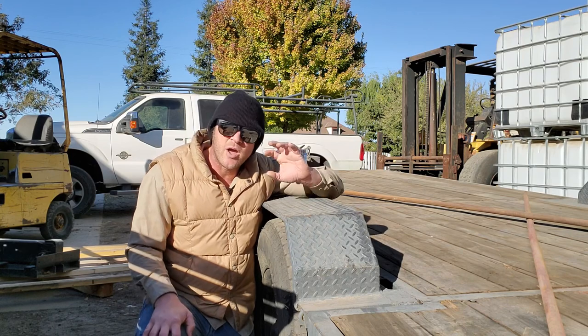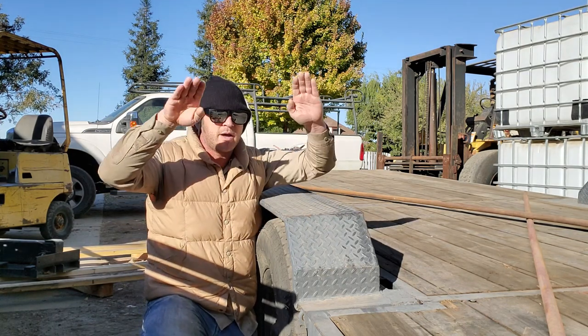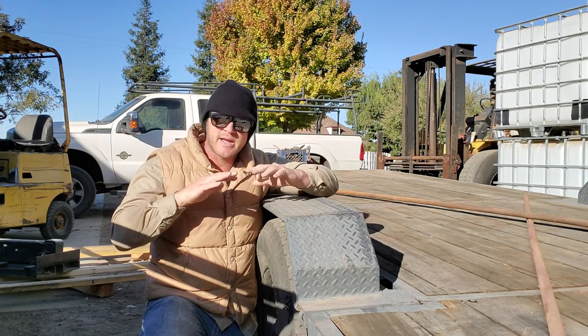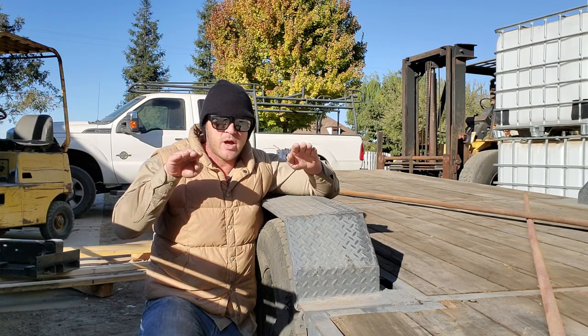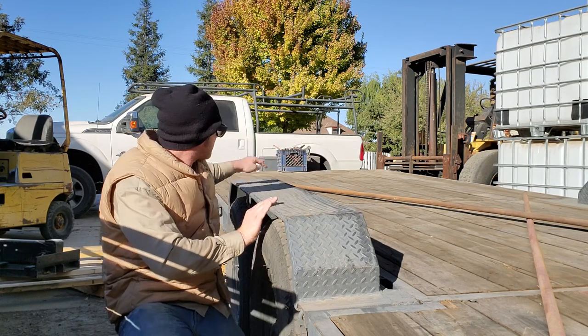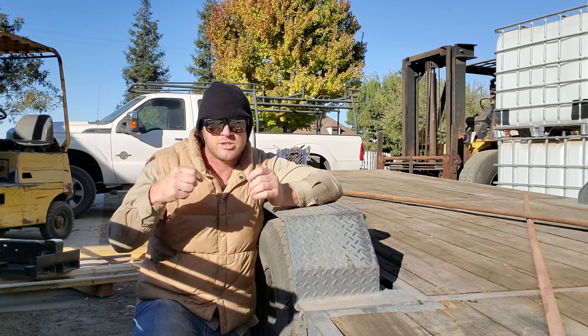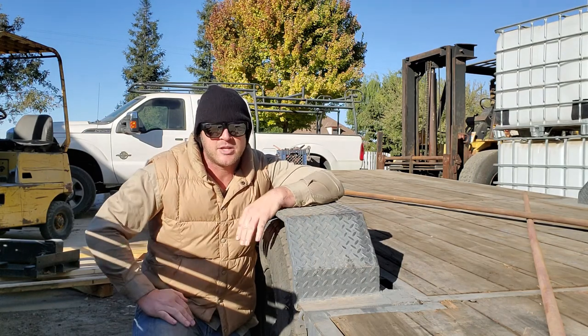Most likely. And the only other thing that I've really noticed is when I lift this beaver tail up and then let it drop back down on the locks, now that everything is kind of settled in and broken in, it's not quite 100% in line with the rest of the trailer. All that entails is me taking a little 1/8-inch shim and welding it on top of the lock. That way it stays in there and it shims the back of that trailer up slightly.